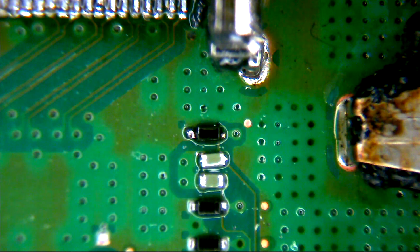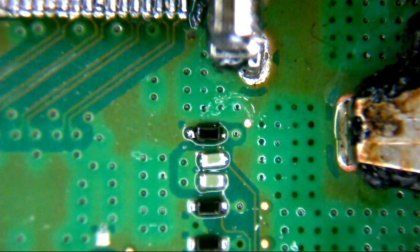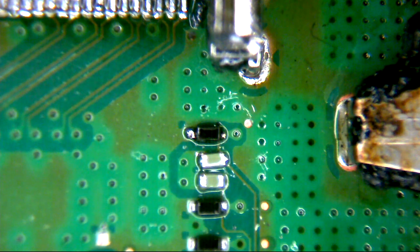You can tell it's been a long old day, and the sense of stupid emanating from this board has really got to me, because I nearly forgot to replace those two components. So we have that protection diode there, which is the black one at the front - that one's back in. We've also replaced that little 2K resistor there, directly behind it. So we're going to pop this back together now, and this time we'll see if it works. Hopefully it will and then we should be good to go.